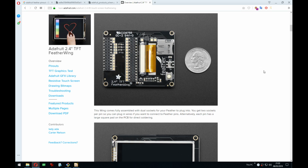So yeah, I will need to have SMD headers for sure, because on the other side of those, it's the keyboard and the LCD, and you can't have pins sticking through those. I want to have double, so even if you mount the feather in, you still have access to all the GPIOs, even though you can also stack them. So you will have two ways to do it. So that's good. Then I will reuse the GPIOs that they use for CS, DC pins here. So that way the libraries made for this should also just work on my board.